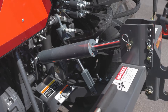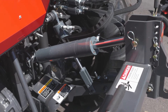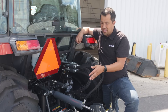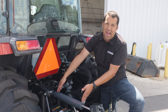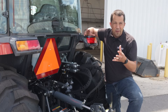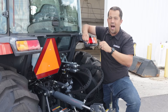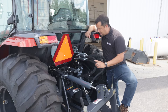You're going to have the same balls that go in the back of your tractor or onto your implement, but this cylinder can now be adjusted from the cab. It's important that you not throw just any old cylinder back here because there are still geometry considerations — the stroke length of the cylinder matters, as does the size of the barrel. It's best to stick with ones made for your tractor. Dropping a cylinder in here means you're not having to get off the machine and twist the top link to change its length; you can do it right from the cab.